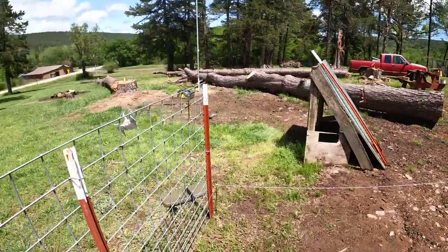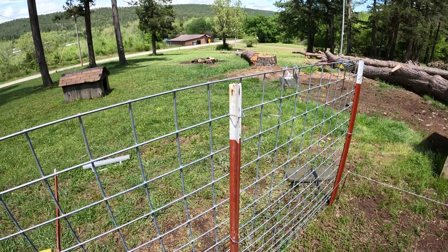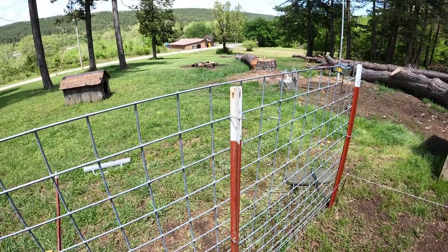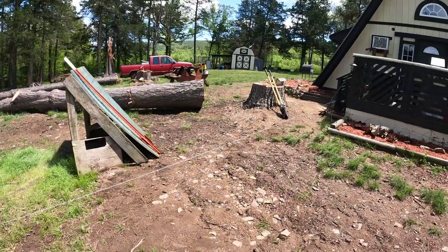What I do when going uphill: I measure down from the top four feet because I want two feet in the ground. That way every post goes in two feet regardless of the lay of the land, so all of the T-posts should be level at the top of the fence panel.